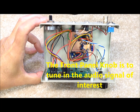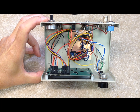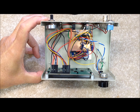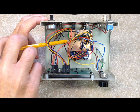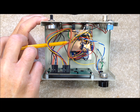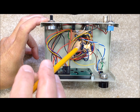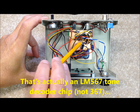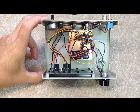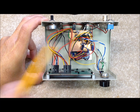On the inside, we ended up with a little scrap piece of copper — this little rectangular board that we built our LM567 decoder module on, along with a little small general-purpose transistor driver right here. We used a 2N2222, which basically just boosts the incoming signal up enough that we can drive the LM567 appropriately. It's really hard to see — it's back behind this green capacitor, mounted upside-down, dead bug style. If you solder in the ground pin there, that holds it really well, and all the other pins are just soldered directly with the various components.